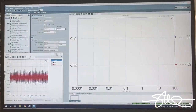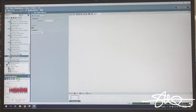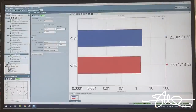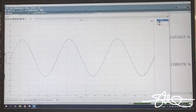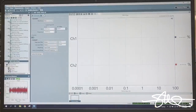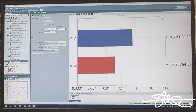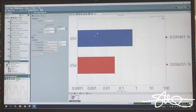Let's go back and look at these two manually. 10 volts input, 40 hertz - there it is: 2.6% THD and 2% THD. Can we see that 2.6% on the scope? It's a little pointy right here and it's a little bit leaning. That's what I see. At 1k: distortion on the right channel is good, left channel not so much. Can we see anything? Not really - a little roundy again.